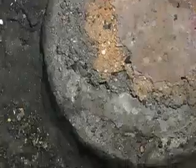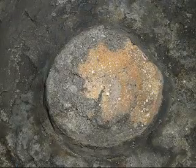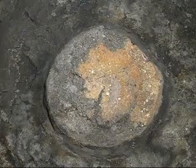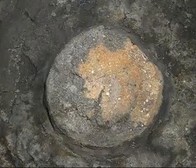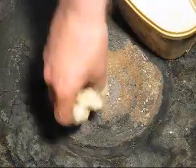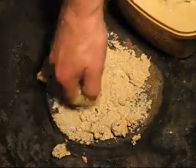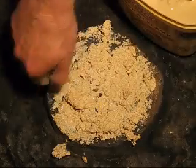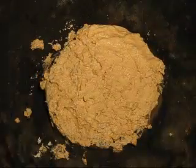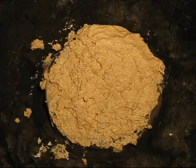Here is a close-up of my pedestal. As you can see, it's got a bit of wear and tear in it — I have to patch it up again with some more ganister. I've made up a really sloppy mix of ganister, nice and wet. The idea is to moisten the original surface so it'll stick. The rest of the ganister has been mixed up with the barest minimum of moisture to make it still workable.